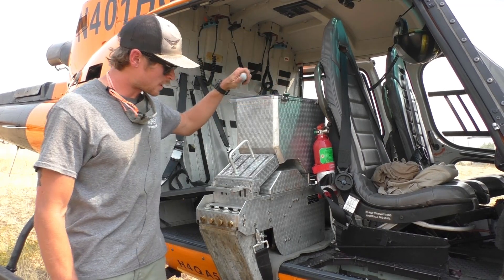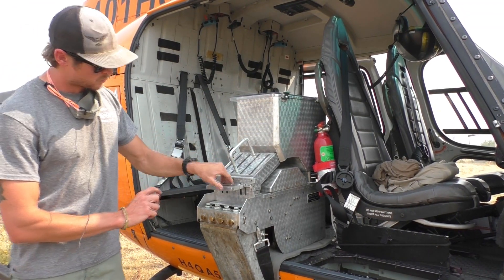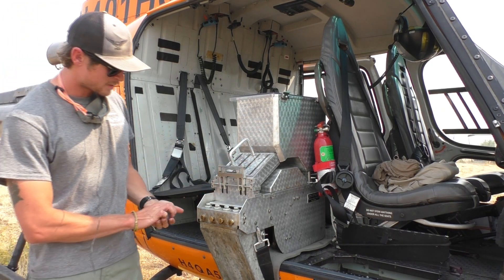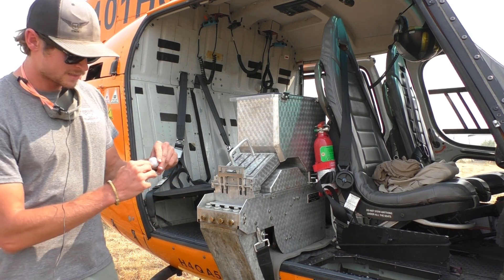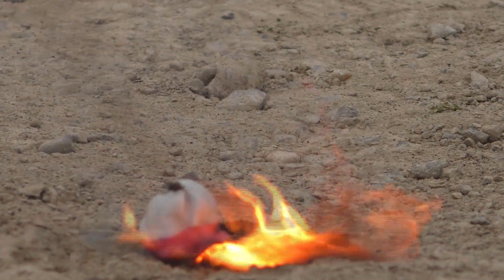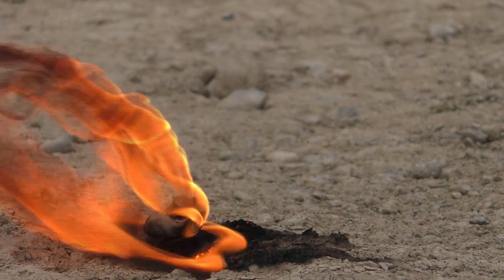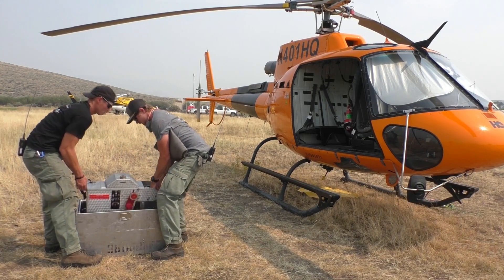So the PSD spheres start out in the hopper, they'll fall through these chutes here, where I open this up when he says firing. The sphere will fall into here, a needle will inject it, puncture the ball, glycol will spray in there, the ball will fall out of this down to the ground, where it will sit there for a second, and then it will ignite and start a fire. We can control how much glycol is pushed into the balls